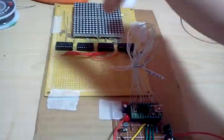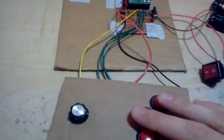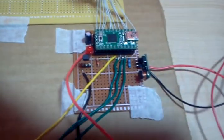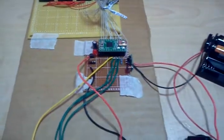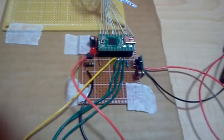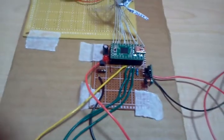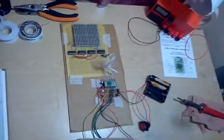This display board will eventually need the bottom half of these wires cut off so that I can fit it in the enclosure I want to use and also fit the controls at the bottom. This board I will probably end up remaking completely because I just rigged it up for testing and it's not the best layout. I also need to make space for sound hardware and I may end up using two voltage controlled oscillators so I can have two independent square wave channels, or I may just go with one. I haven't really played around with that enough to make a decision yet.